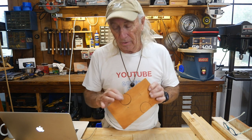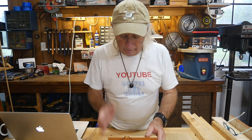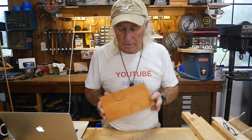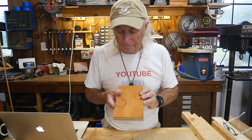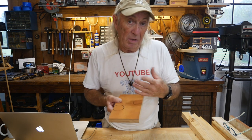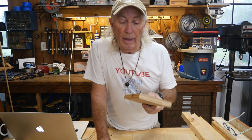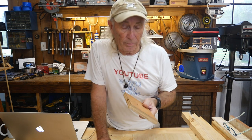At 500 cycles to get say three-eighths of an inch, I would just go cut something with a bandsaw. It's just too much time, too much power, and the results aren't there. But if you bring the laser head down and cut again — maybe another 50 to 100 cycles — and just kept doing that, you could get through a three-quarter-inch piece of board.